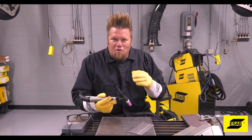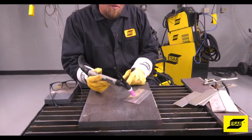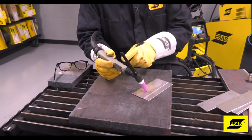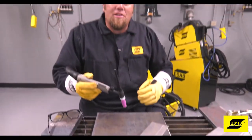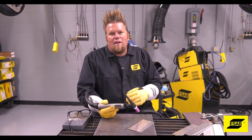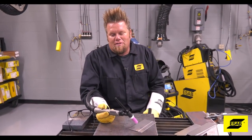This is where the confusion starts. The LIFT arc requires you to touch the tungsten to the material, then press the button on the torch and break the contact between the tungsten and the metal — that is what starts the arc. It is not a scratch start where you drag the tungsten across the metal, and it is not a high frequency start where you hold it close and then energize the tungsten.